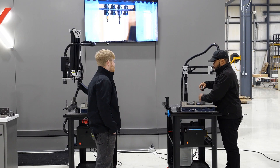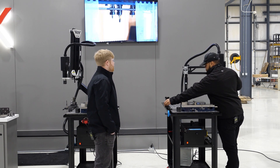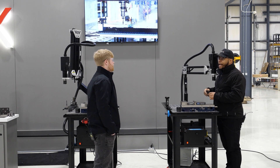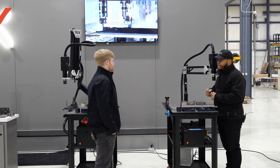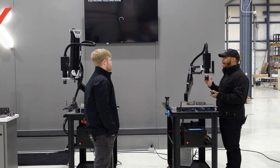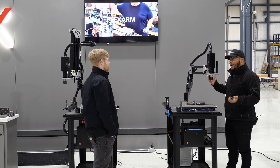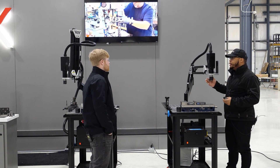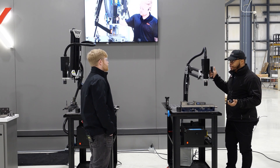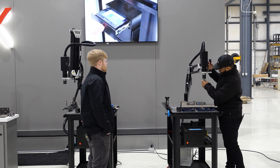You said you can do more than just tap with it. So if it's a laser cut hole, you can put a reamer in there or chamfer it. But can it drill material? We get that question all the time. The answer is no, because there's no rack and pinion on the flex arm. It specializes in a low-RPM, higher-torque solution, and the downward force would have to come from the operator. That's why we steer customers away from drilling with it — though we do have drilling solutions if needed.